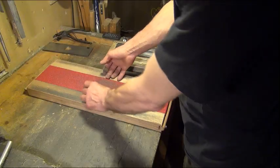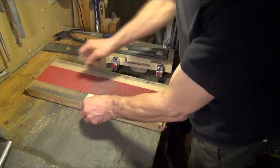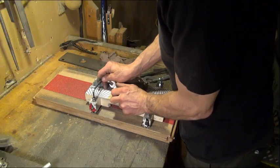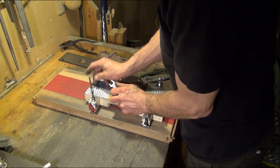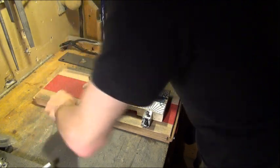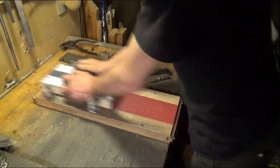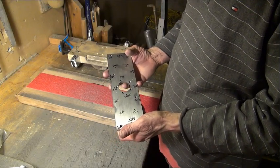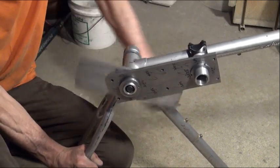Then I added adjustable casters that helped level the shuttle to the nearest thousandth of an inch. Finally, I changed the surface of the sandpaper — I raised it up slightly in the middle so that part was the only one touching the blade, and it was wearing evenly. Each mark on the adjustment is for one thousandth of an inch. After 10,000 strokes on each side, all that effort paid off and I had a flat, smooth, parallel plate. I had two of them, in fact, that ran against each other without gaps or tight spots.